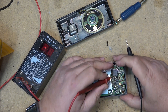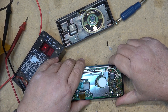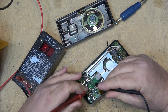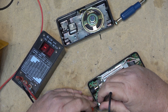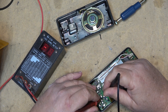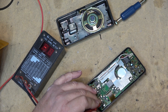At 35 volts - I've got to change these ones. I bet if I just change the same four I changed before and add this one here, it will work. How are these ones over here - any good? They weren't bad the last time, that's why I didn't change them - they were measuring okay. Those ones are probably still okay. Some of them could be heading up there for sure, but they aren't open.